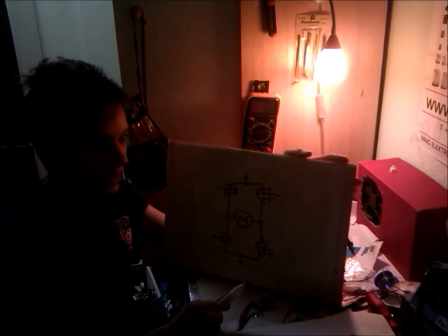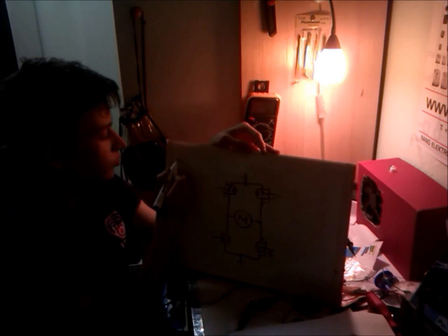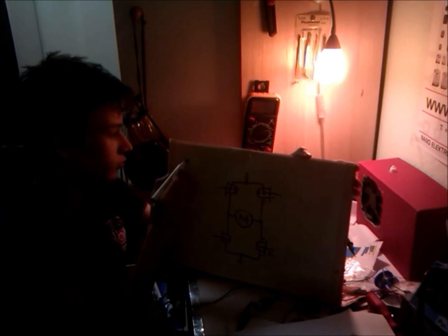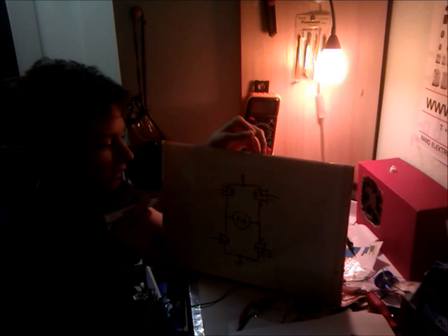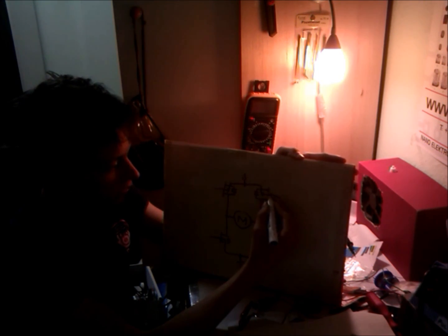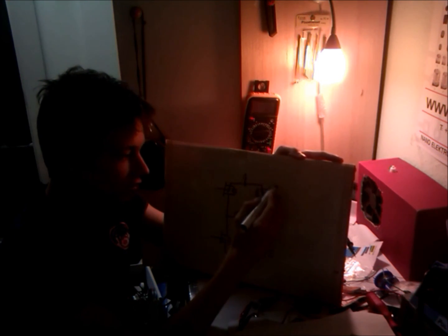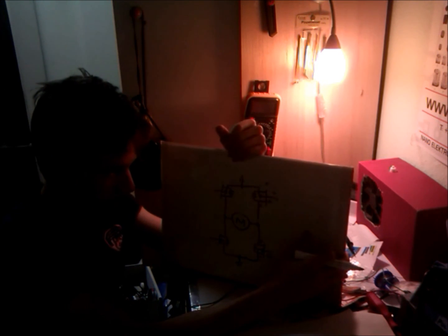Now, MOSFETs act like some sort of a switch: when they're activated, their resistance is low, and when they are not activated, the resistance is high. And now, what's the difference between P and N channel? The MOSFET is activated by the voltage between gate and source. You should know that this is a common mistake, and I'm gonna tell you what's so bugging about this one.